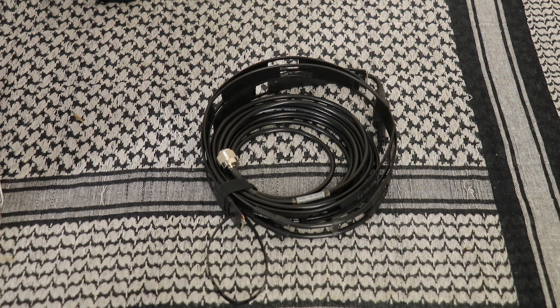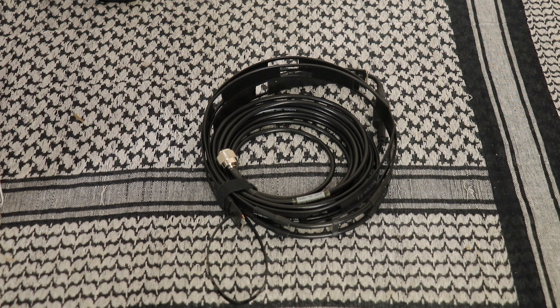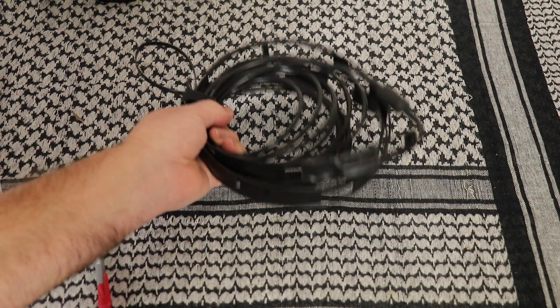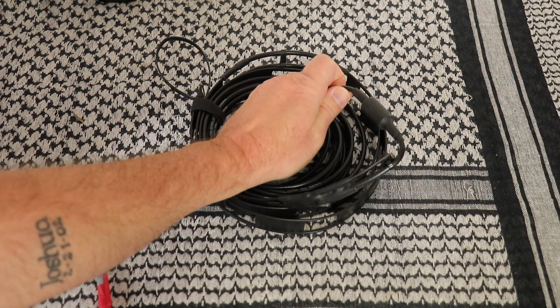A great inexpensive antenna if you want to turn your mobile radio into more of a base station is the N9TAX dual band, 2 meter/440 Slim Jim antenna. You can get it with either a 10 foot or 16 foot cable. It handles 100 watts, uses RG58 cabling along with ladder line, and on the cable there's already a ferrite choke balun installed.